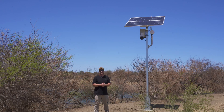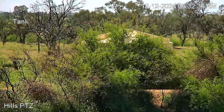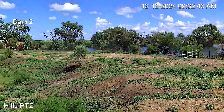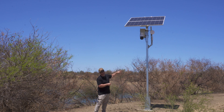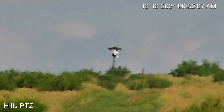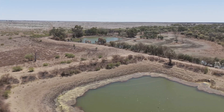So we're here at one of the dams on the property and we've put a PTZ camera here. We've got a dam here, we've got a tank which we can put a float on top, and we've also got a trough. Once you clear some trees, you'll be able to see that trough with the PTZ. Behind the camera there's actually another dam that's linked to. So our pan, tilt and zoom camera — we can jump in and set presets or manually zoom into each of the crucial points, checking on the water level without having to come out here. Underneath that dish we've got our Wi-Fi access points. We're taking the internet from the homestead, bouncing it out to one of those repeater stations, sending it back down here, and now we can have Wi-Fi. Crucially, we can make a phone call and have some connectivity.